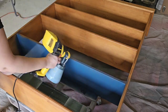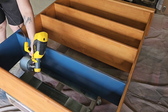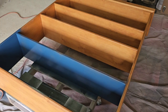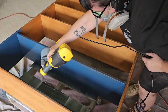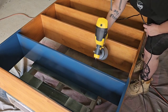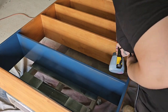The reason I've got the bookcase laying down on its back like this to start off with spraying is so that I can get both the tops and the undersides of all of the shelves. I thought this was going to be a lot easier than having it standing up but it really wasn't — it was still super awkward and super clunky. This is a great spray gun but I'm looking forward to getting something with a little less bulk on the back of it. What I'm doing here is twisting the nozzle on it so that it changes from spraying a vertical line to a horizontal line, which did make a big difference in how easy it was to spray these tight corners.